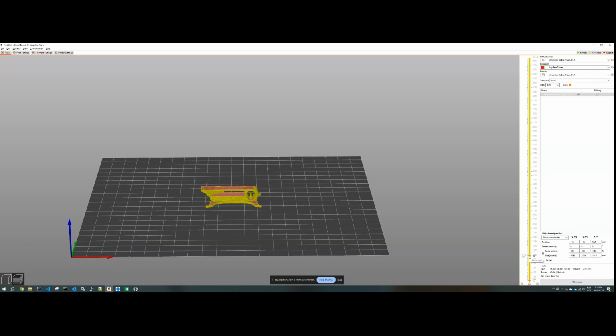After slicing, change the option to view the temperatures and each piece will show a different temperature. I usually make the tower for all new spools. I leave the code saved on the SD card and set it to print directly. I end up doing this as the first print of each filament, which already gives me an idea of the ideal temperature and an idea of how it behaves.